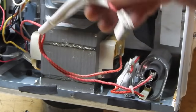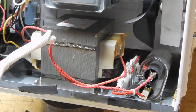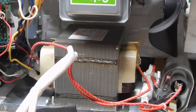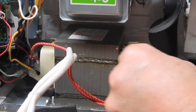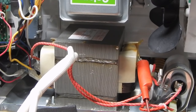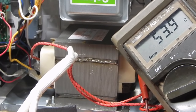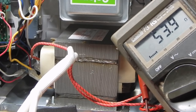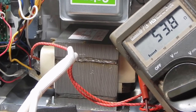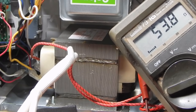In case you're wondering, it's probably around 3 to 5 kilovolts coming out of here, and it's rectified so it's DC. Now the secondary high voltage tap - the other end of the winding is grounded, so if I go to ground from that tap I'll actually be measuring the high voltage winding, and it's 54 ohms. As I recall, somewhere between 50 and 70 ohms is normal. There's nothing to really indicate that that's a short circuit.